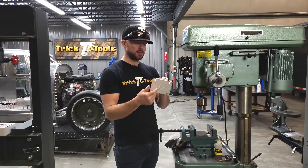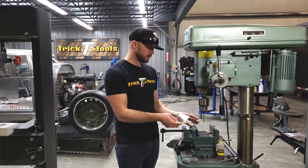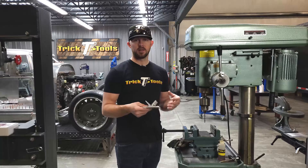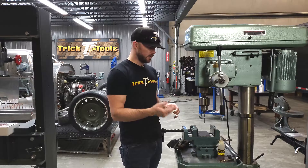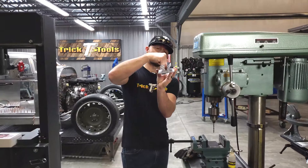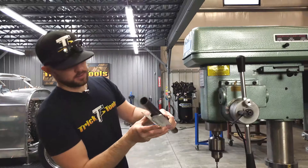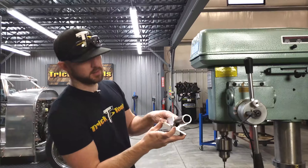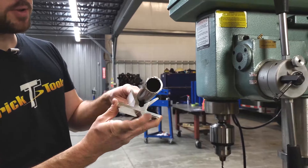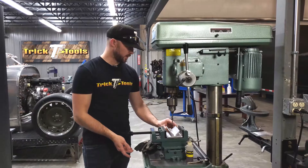There are some little notches in the base plate that you can use to bolt it down to a surface — bolt down to your drill press table or however you want to do it. I'm using this just to clamp in the vise as a quick way to get it in there and set it ready for drilling. There's a little recess in here that allows some clearance for your drill bit to go through, so once you set your tube in here there's that little space in the bottom that allows your drill bit to go through so you're not just drilling constantly down into the jig.